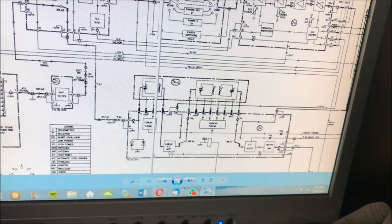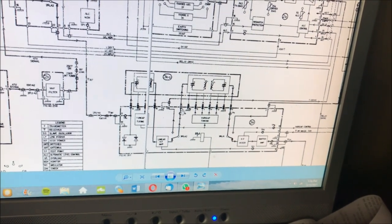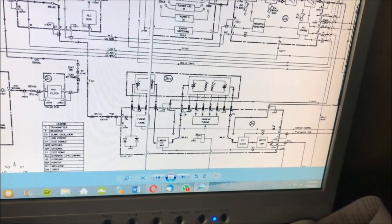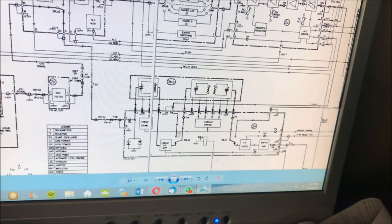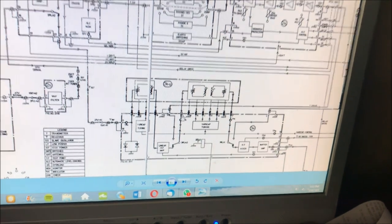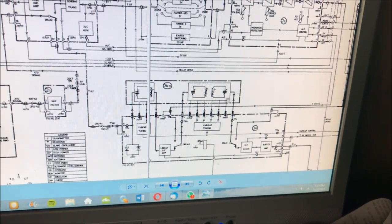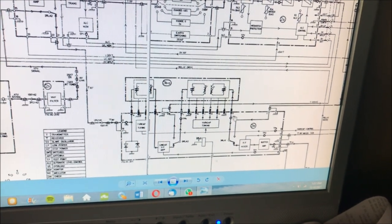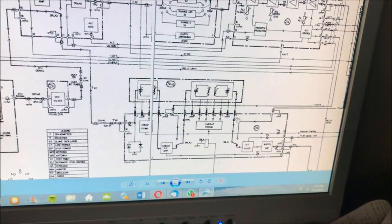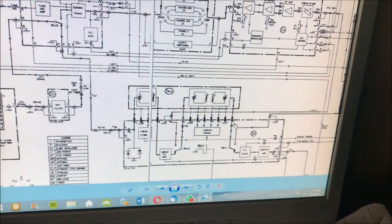Then we're going to go through here, the linear RF amplifier. I'm going to go up onto L, and I'm going to expect the signal to be amplified by the amplifier here, so I'm going to get a bigger signal, same frequency. And then through the varicap tuning, and back out here to F. At the F point, I should get a very, very nice clean signal there at the same frequency again.